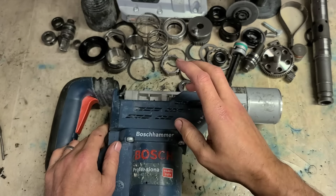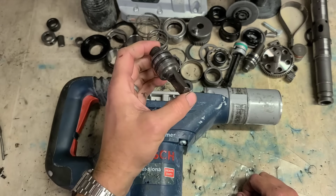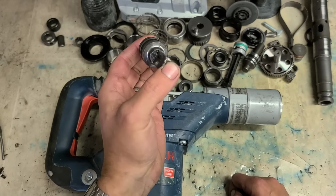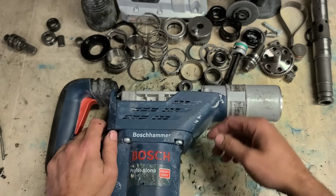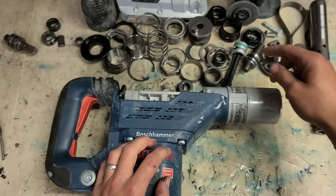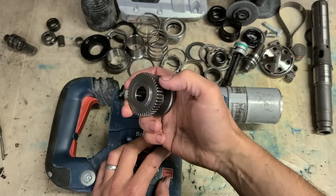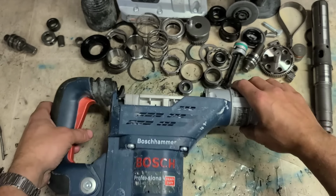If you don't wash it out, then pieces of metal, bits of debris, actually off a striker bolt, a piece of hard steel, seriously hard steel, that's getting hammered both sides, hammer this side, chisel that side. That breaks off, it's going to cause all sorts of damage if not taken out, obviously to your tool holder, but also it's going to wear out your seals as well. Worse than that, if you leave it on there, eventually it's going to get to your gears. A piece of that actually wedges in between the teeth. That's going to break off your gear teeth.